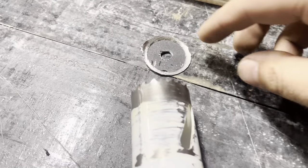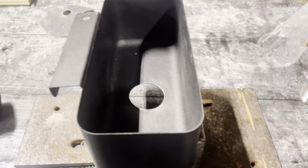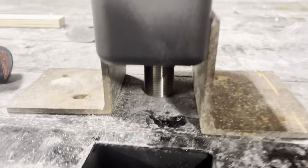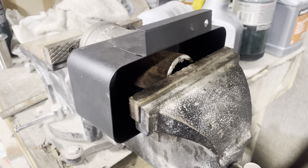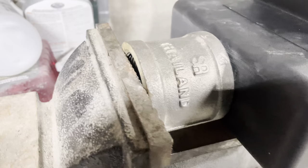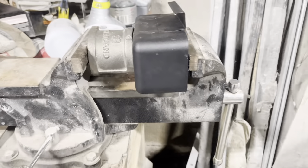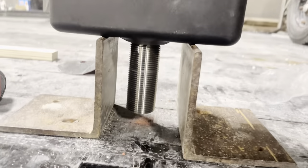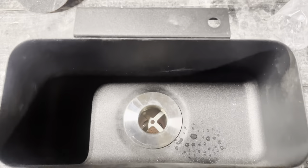To start off, I took my grease cup and drilled this hole out of it with a 1 and 3/8-inch core bit — just big enough to fit my 1.25-inch outside diameter drain through. It does have a flange on top, so we put a 2-inch outside diameter pusher onto a 2.5-inch inside diameter backer in the bench vise and get it tightened down. Now we're left with a dimple around the hole, so the drain fits flush — if anything, a little bit lower — allowing the grease to drain completely downward and not stay in the trap.